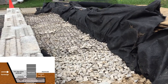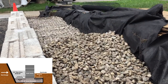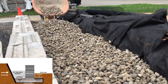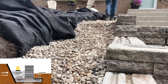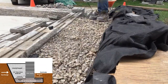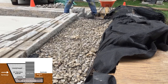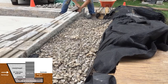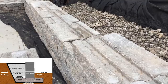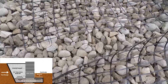Backfilling of the wall is completed in stages as the wall is built. We backfill using ¾ inch angular crushed clear stone with no fines, backfilling to one level below the last completed wall row and compacting in lifts according to the compactor's rating. If required by engineered drawings, a uniaxial geogrid is installed to stabilize the aggregate behind the wall, preventing movement and pressure on the wall. It is rolled out perpendicular to the wall and cut — not parallel — because uniaxial geogrid has strength only in one direction, which must extend into the backfill.